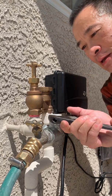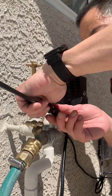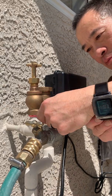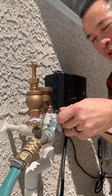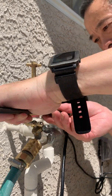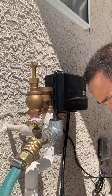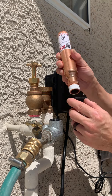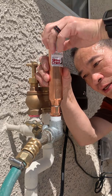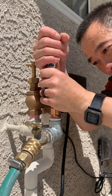Crescent wrench — it just barely fits over the flats on the plug, but that's good. Surprising how often one needs a crescent wrench. There might be a gush of water from above. I tried to drain the system. Putting two or three wraps of Teflon tape around this — you can use pipe dope if you like, but Teflon tape has always worked for me and is a lot neater. Screw this in hand tight and then really whale down on it with the wrench.